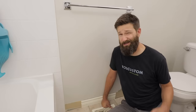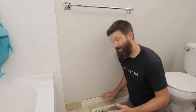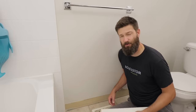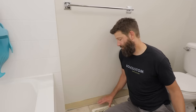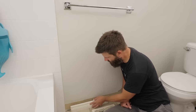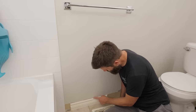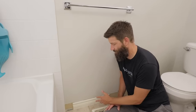This next one is so simple to avoid, yet extremely catastrophic if you don't. Basically, anytime you're going to replace your baseboards, there are two fundamental principles you cannot ignore. Number one: when you get a new baseboard, you need to get one that is at least the same height, if not higher, than the old baseboard. For example, in this bathroom I'm ripping out the tile and replacing it with vinyl plank. The vinyl plank is not going to be as thick as the old floor, so if I tried to reuse the baseboard or a new baseboard of the same width, with the new floor it's going to sit a quarter inch lower — and that's an absolute no-go. You can't caulk that. It's perfectly okay to come up to the existing line, but under no circumstances do you want to go below it.